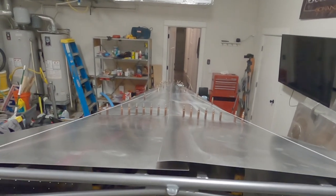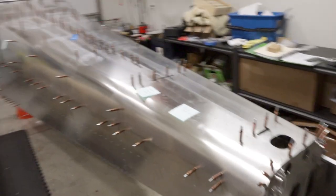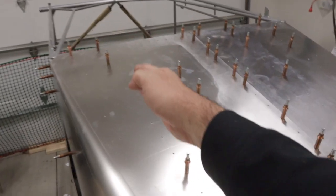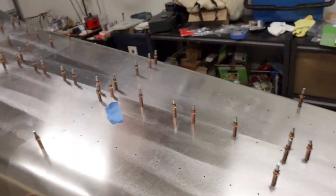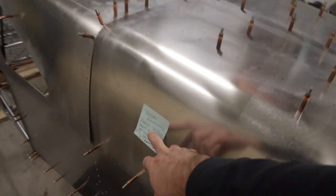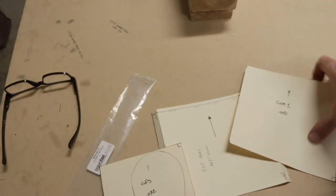Let me update you on what I've been up to in the last couple weeks. Getting these holes located, drilled, and final sized, as well as final sizing the spine — I just did that. Now I'm ready to take everything off and clean up these skins. A couple reminders for myself: I've got to drill holes in the window support bracket and rivet those in, get my antenna mount and some doublers in, and put powder pins in the pulleys. I've made some templates to take to the local EAA chapter to break and shear out of stock.